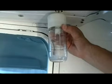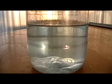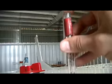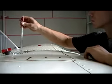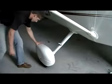As we sump our fuel, we're looking for aviation blue avgas, no water or impurities. I find a lot of students don't know what water looks like in fuel, so here I'll go ahead and show you. Notice how the water bubbles up at the bottom and separates almost like Italian dressing. This is an easy indication there's water in our fuel. Now, although that fuel won't make it back in the tank, it's still important to get up and visually check our fuel. I like to use a fuel stick to do this, to verify our fuel gauges are working properly. Also, be sure to put your fuel cap on nice and tight.